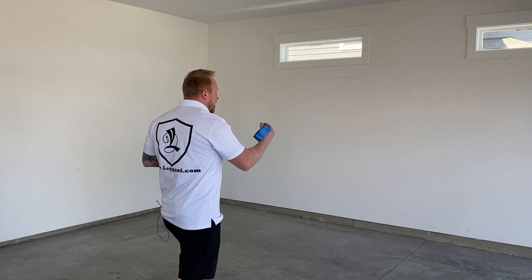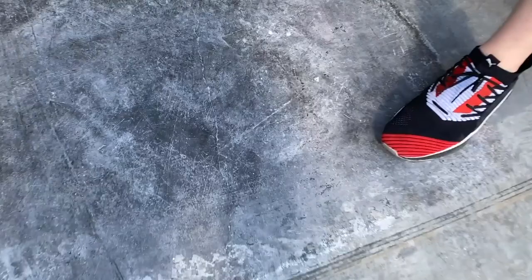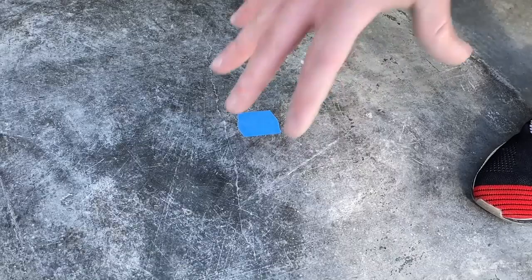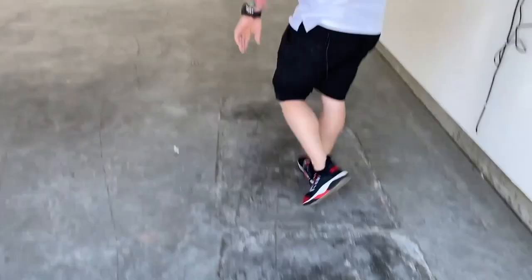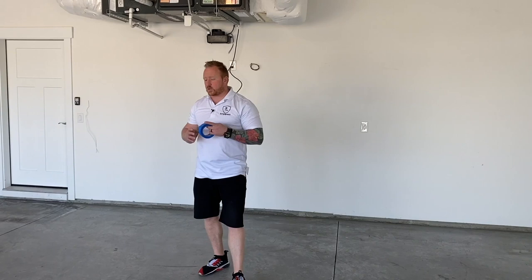If you're walking through the garage and you see a crack somewhere, like right here, here's a crack that's going through the garage. Now this is a very small fracture crack. It's not very big. I might even put tape next to that just to remind me where the cracks are at, because we don't only want to fill in the control joints. These are called control joints. We want to fill in any little fracture crack, any type of crack that we can see that's big enough that you can see it with your eye. So that's what we're going to do now.